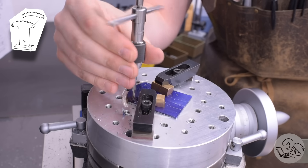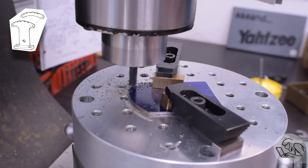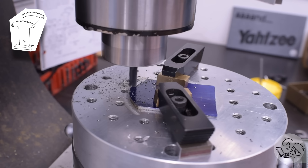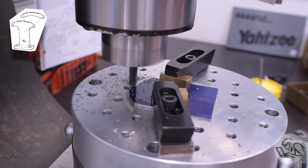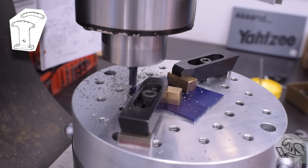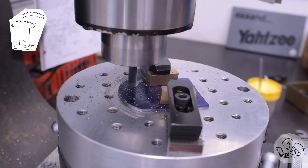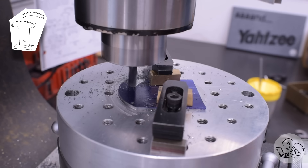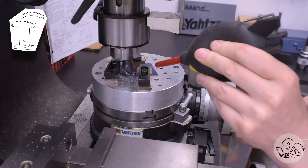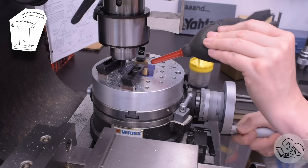I also drilled and tapped the holes from this same setup because those are set on an arc, and then I recut that top arc — because I calculated the offset with the diameter of the end mill instead of the radius, but I'm also not not saying that. I then made a similar cut underneath the drilled and tapped holes to create the broad outline of the little arch piece. This let me take advantage of the offset set up on the rotary table, since all of these arcs are similar radii — the outer arcs of each are the same, and the slightly smaller inner arcs are the same.